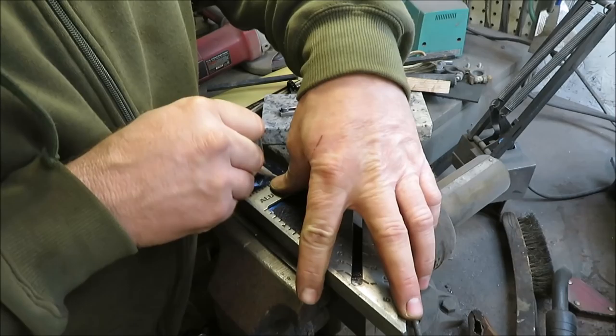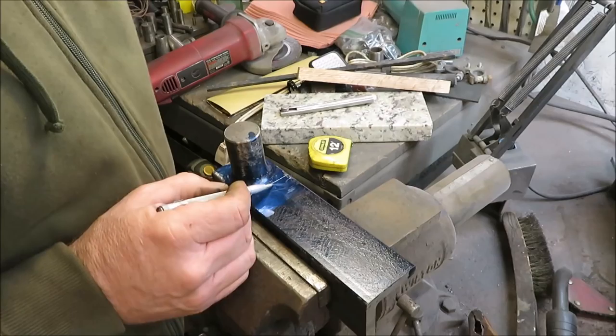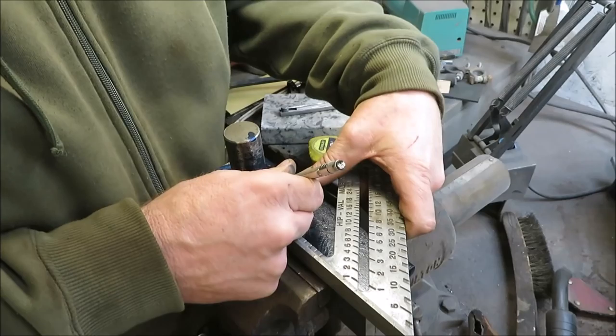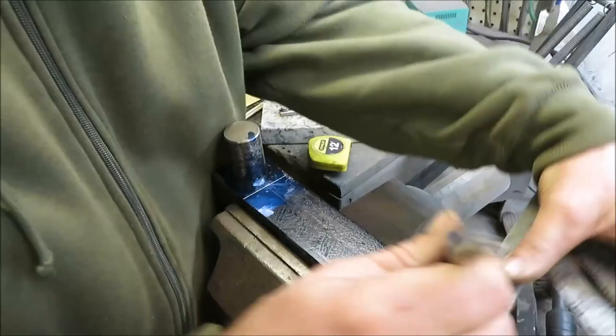So we know that when we bend this, we want the center of this now. And we want to split the difference. That way I can put my other pin off to the side over here. That way when you wrap it around this, then you bend it, it'll be straight. So we want it to be straight down this thing. So let's see, this is a 2-inch piece of stock. We'll say 1 inch right there. There's right down the center. So there's our center mark right here.